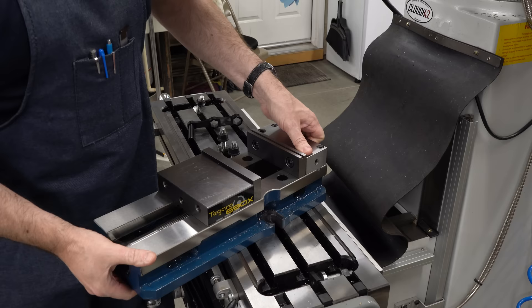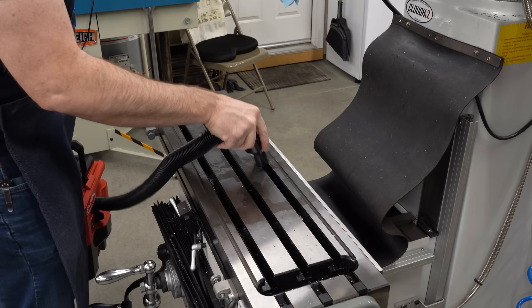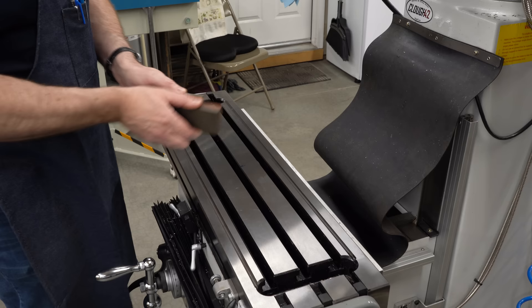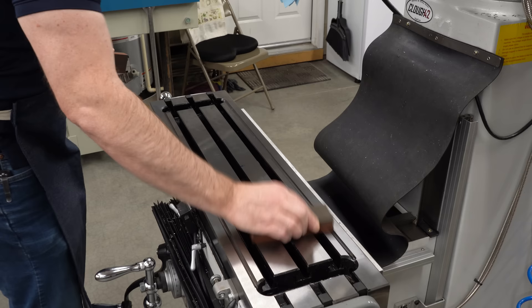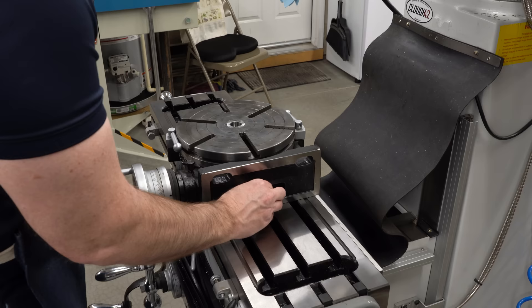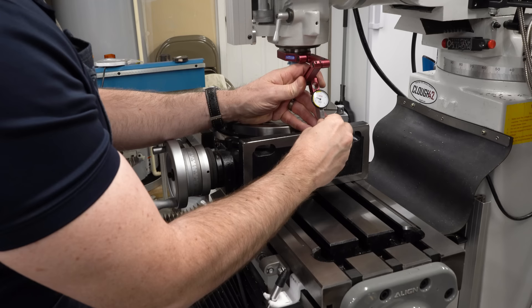All the rest of the parts are big enough to mill with the rotary table, but to use it my beloved dual vise setup has to come off the mill. It's an extravagance but something I've really enjoyed — I really don't know how I survived without two vices. While everything's off the mill we might as well clean up and check the condition of the table. I'm running precision flat ground stones over it feeling for any nicks or damage — and feeling absolutely nothing. Those aluminum table protector trays are paying off.